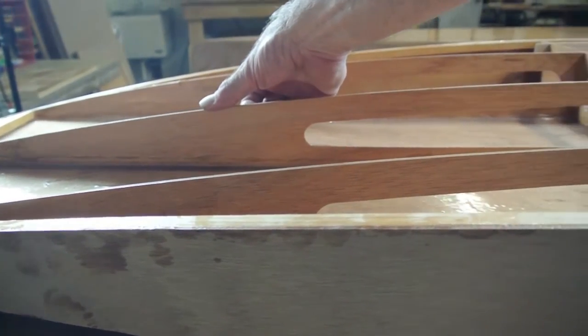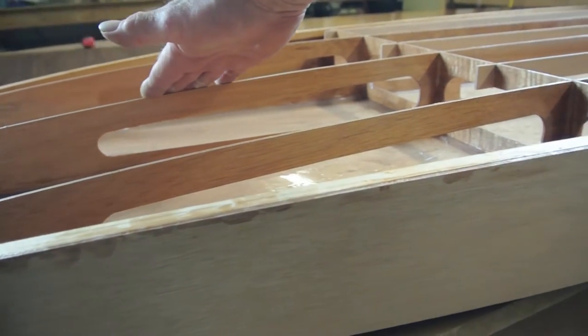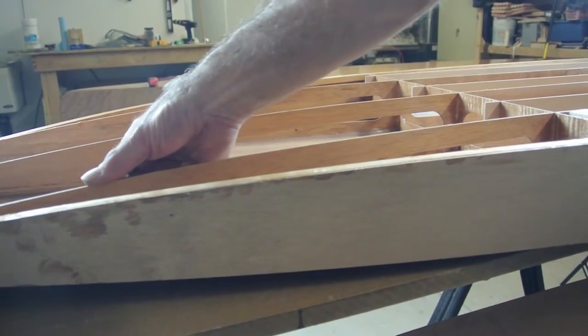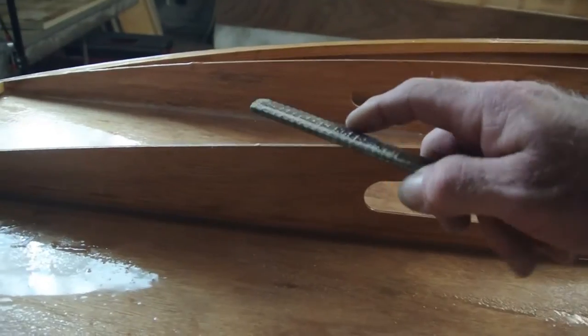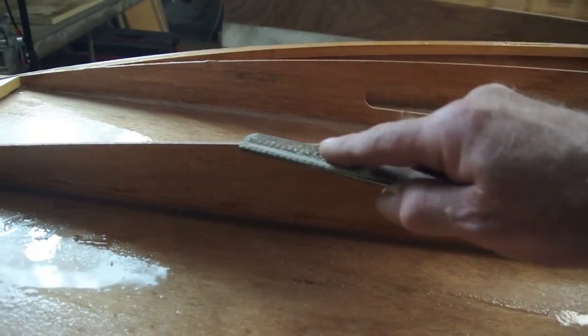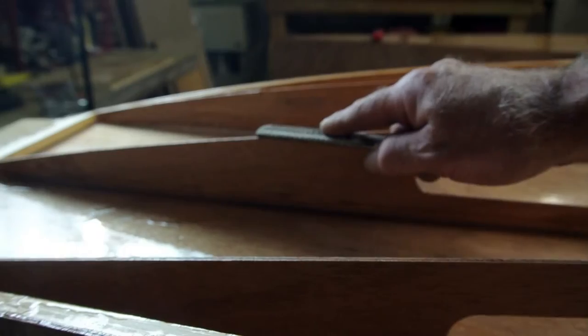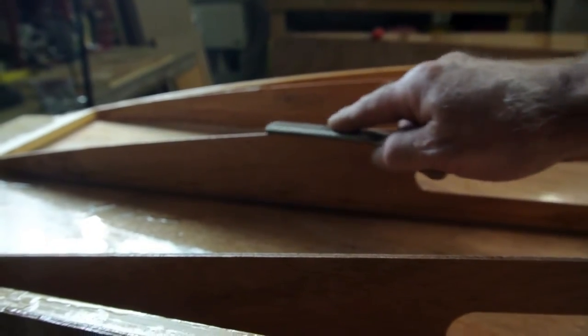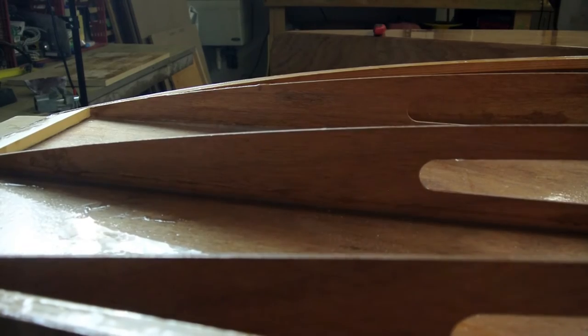Check all of the surfaces where the deck panel will make contact with the boat. Look for hardened blobs of epoxy that might have squeezed out from joints that would keep the deck from setting down flat on the frames. Run your fingers along the top of each frame and shear clamp and feel for any epoxy that is protruding. Use a rasp or some sandpaper to smooth those areas.